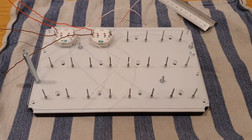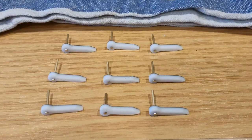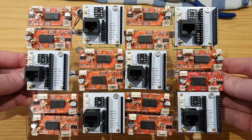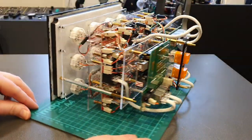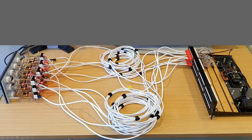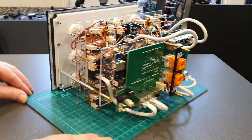Other improvements related to accessibility, such as how the stepper motors were mounted, removable needle pointers, and to overall make a contained unit which incorporated the master as well as the slaves of the whole RS-485 network. That moved us from the original overall prototype and the network it ran on to just one single unit which doesn't exceed the footprint of what was just the original slave EMI panel itself.